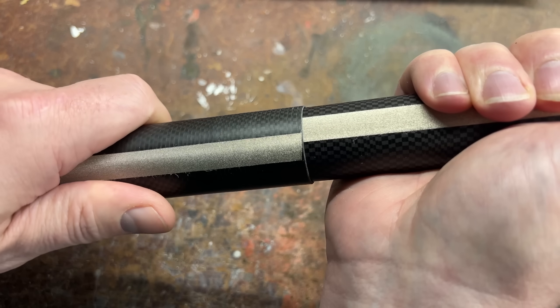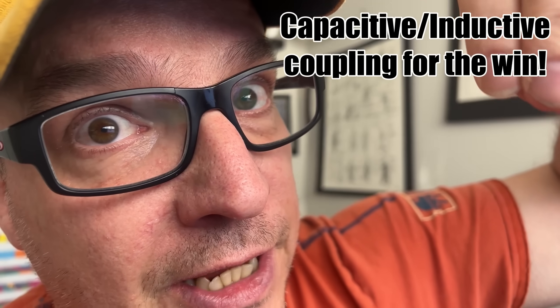This is only an intro into the basics of this antenna — I do plan on doing a whole lot more experimenting. We need to establish what the capacitively coupled sections actually do when you rotate them. Can I get it tuned along certain bands and have faked capacity hats all the way along the antenna? When I start collapsing it, does it still work? Spoiler alert: when you drop one section into the other, it still works — it's really kind of weird. In the comments down below, let me know what you would do if you had one of these. What sort of antennas are you thinking are possible? We can do delta loops, maybe a stand-up Moxon — there are so many different ideas.